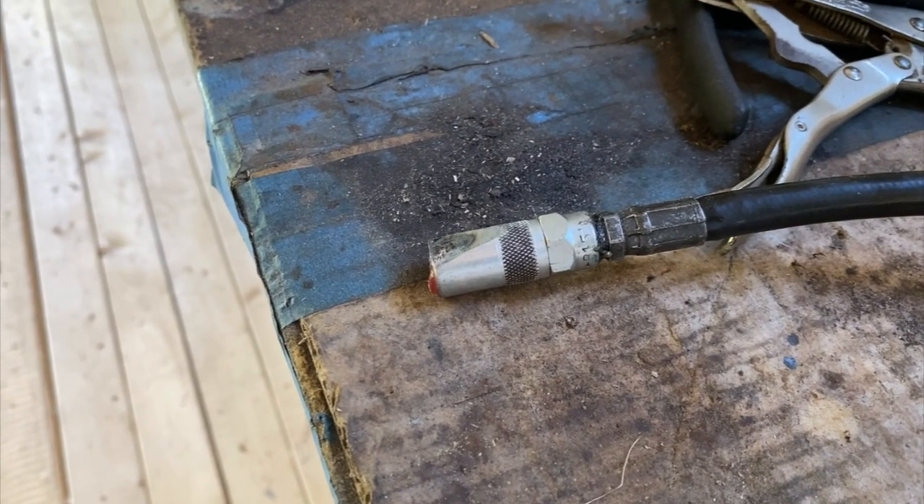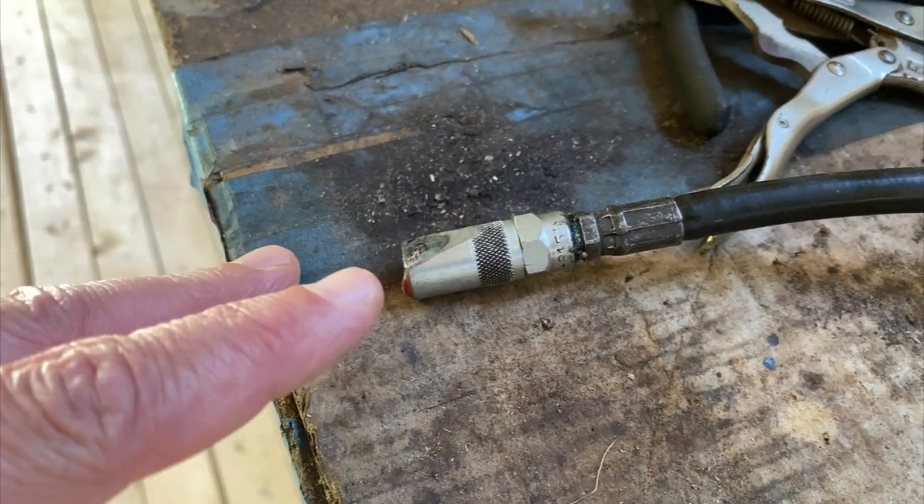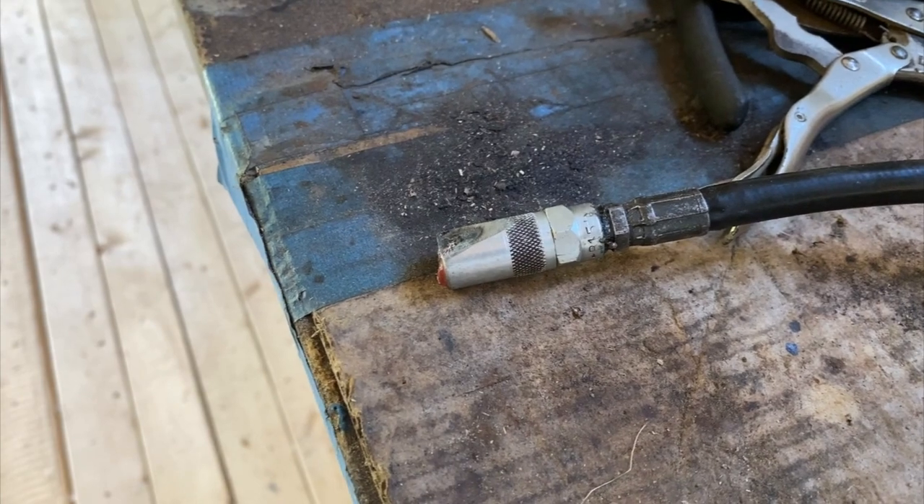Right here is what I'm talking about. You'll notice at the end of this it's ground off a lot flatter, so it can fit in that small little space. So let's pop the grease gun right there on that Zerk and give her four shots of grease. And that one is done.